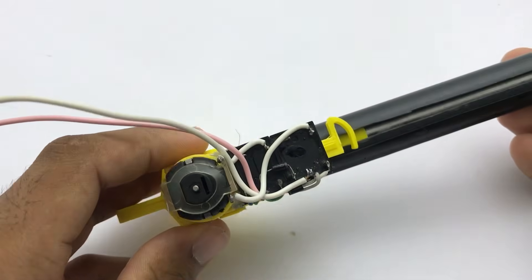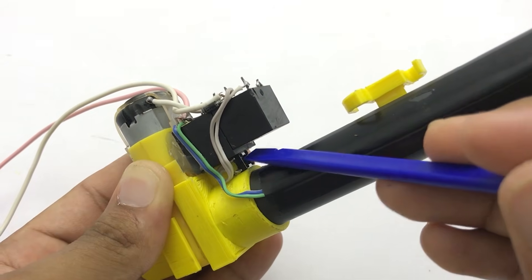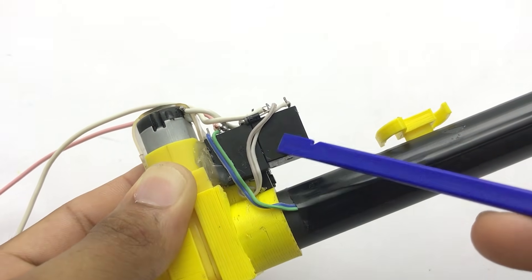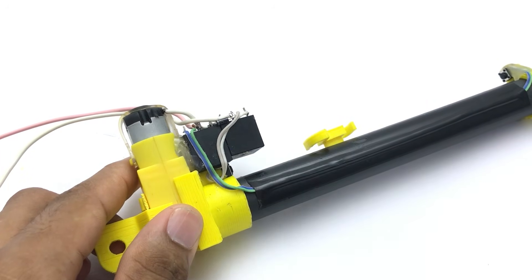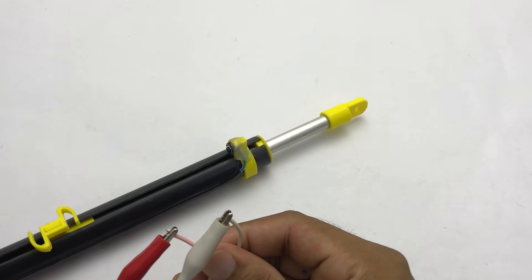So I could improve the safety and durability of the whole system, avoiding unnecessary stresses. I used two push buttons and two relays to control this system. Push buttons give the input signals, and according to them, relays control the motor. You can see how this linear actuator and its limitation system works well.